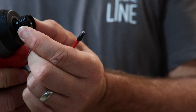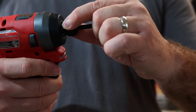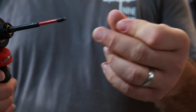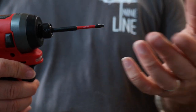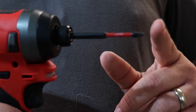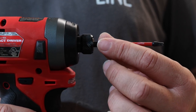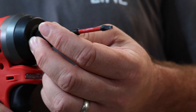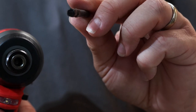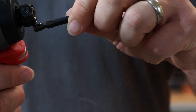The way the impact driver chuck works is by pulling in or out. On older impact drivers, you had to pull it out to get your bit in there, but on this brand new one, you just shove it in and it's in. To get it out, you have to pull and kind of pull the bit out at the same time. The reason the chuck is different is because impact drivers create so much torque that on a standard drill chuck the teeth would loosen up and you'd lose the grip on your bit. The hex-shaped chuck with a hex shank bit prevents that.